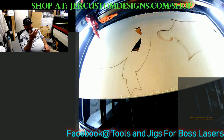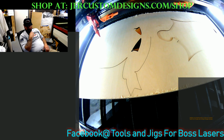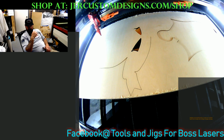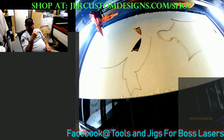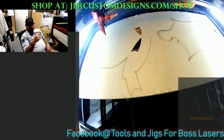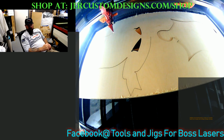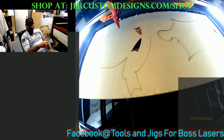Engraving, it still applies, but generally when you're engraving, you're not going to produce as much moisture as you are when you're cutting. So make sure you have a good air dryer system, because you don't want water to get onto your lens when you're doing this, because if you do, the lens can and probably will shatter, or it'll leave burn marks in the lens that you can't clean off or buff out, and you'll have to get a new lens.